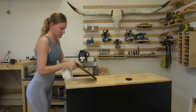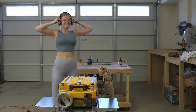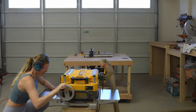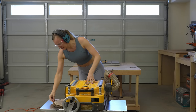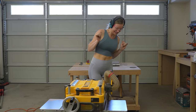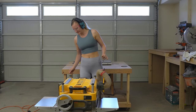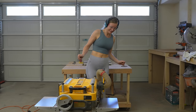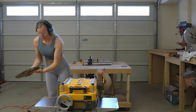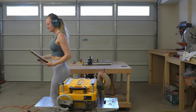To flatten the piece, an easy way is to use either a CNC or a router sled. I'm taking a little risk here by using the planer. It is a little risky because the bark might just chip off. Make sure you take off minimal surface with each turn. Maybe I should have just taken a router sled instead. Make your own decision with which route you like to go — are you feeling a little risky today, or do you just like to go the safe route?